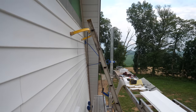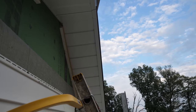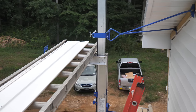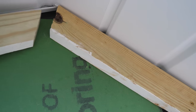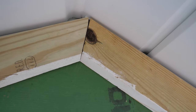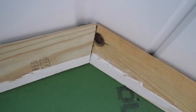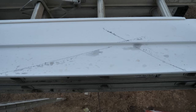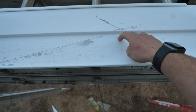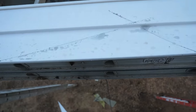We're finally in the home stretch, and to reach this very top peak I had to get the 40-foot extension ladder out. The top of it is probably 26 to 28 feet off the ground, and I'm out of travel on the pump jacks — the ladder was about to hit the anchor bracket, necessitating the extension ladder. Up here at the top we have a 10-12 pitch meeting a 4-12, so getting these to match is a weird oblong angle. I had to guess and check more than once using an angle gauge and a little cardboard template. The very last piece won't be full height so there's no nailing flange — I'll put one white stainless trim nail right in the top, it'll be clipped along the bottom, and the PVC trim board will overlap it anyway.